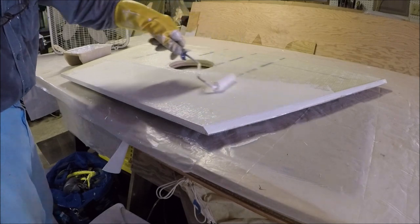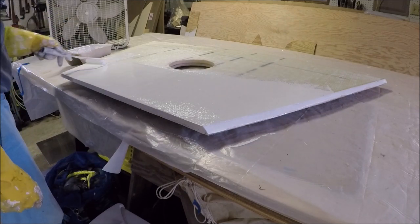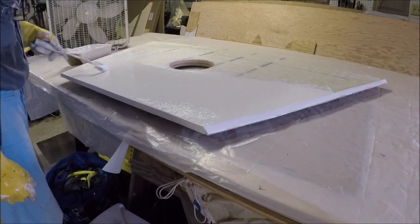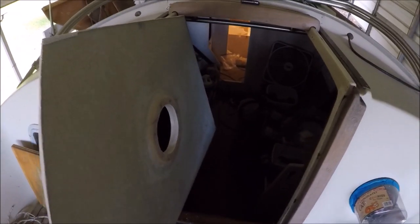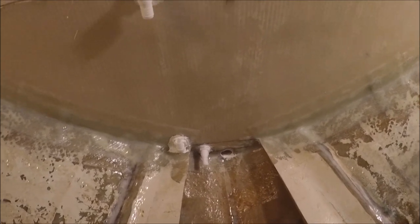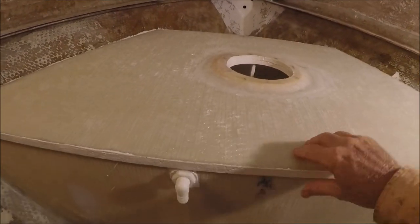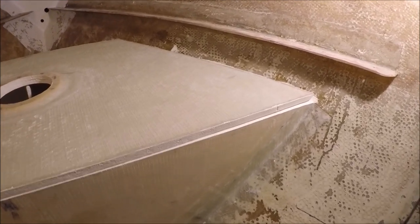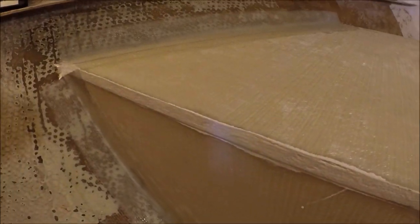The bottom of the lid is coated outside the boat to install later, because it's not possible to get the tank coated through the small access hole once it's fiberglassed in. Don't build any cabinetry panels that are too big to fit through your hatch. With all fittings in place and tank coated, seal it down with thickened epoxy under the joints and fiberglass along the hull. Fiberglass down the top sides, put thickened epoxy under all other joints, and fiberglass those later.